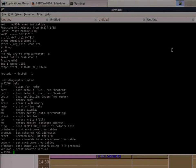Yeah, no, for the U-boot stuff, I would have to hook up a JTAG burner to change U-boot. It's part of the bootstrapping process of the machine. Right. It's separate. Yes. Okay. I will not be modifying U-boot. No, this is the D-Link modified version of U-boot for this router.